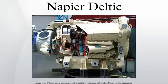The Turbo Compound Deltic, or E-185, was a Compound Deltic turbo compound variant that was planned, and a single prototype was built in 1956 and tested in 1957. This capitalized on Napier's experience with the Nomad and its increasing involvement with gas turbines. It used the Deltic as the gas generator inside a gas turbine, with both a 12-stage axial compressor and a three-stage gas turbine. Unlike the Nomad, this turbine was not mechanically coupled to the crankshaft, but merely drove the compressor. It was hoped it would produce 6,000 horsepower, with fuel economy and power-to-weight ratio second to none. Predictions were that connecting rod failure would be the limit, failing at around 5,300 bhp. On test it actually produced 5,600 bhp before throwing a connecting rod through the crankcase, just as predicted. Naval interest had waned by 1958 in favor of the pure gas turbine, despite its heavier fuel consumption, and no further development was carried out.